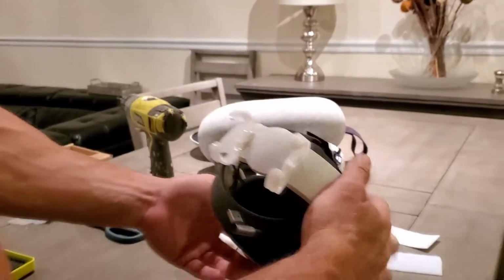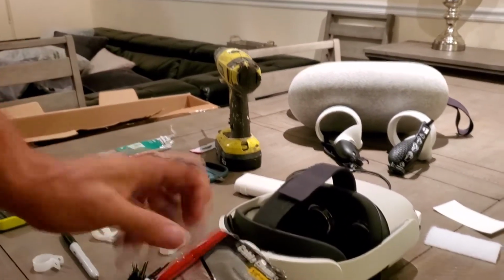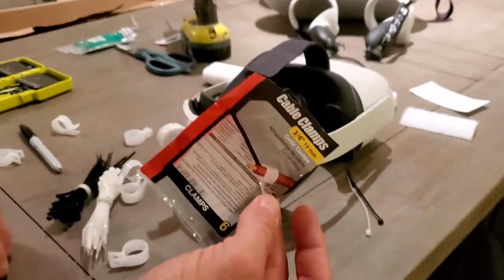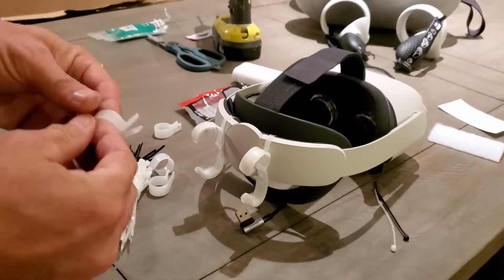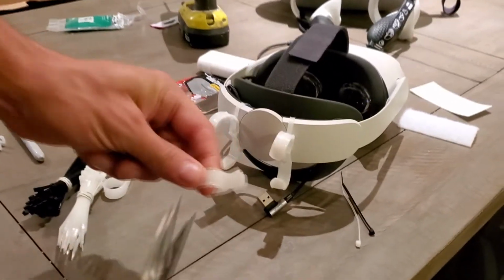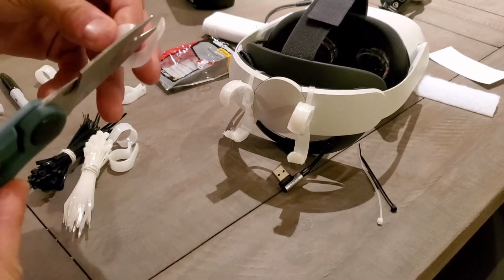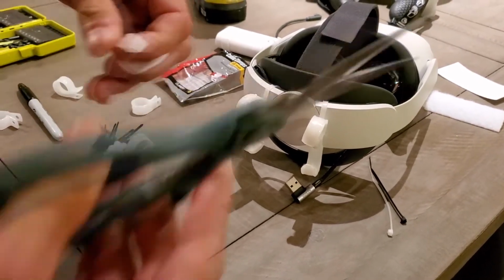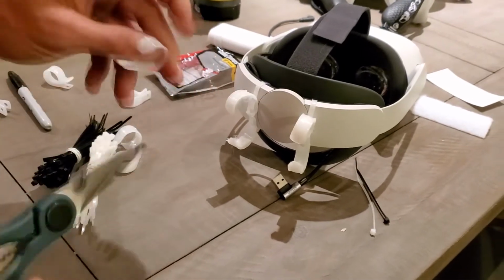So they're clamps that are used in the electrical department. They're 3/4 inch cable clamps, Home Depot, quantity of 6. They come like this. So the first step is to, hopefully my daughter's getting what my hands are doing, cut off these tabs here and then nip off, shape them how you want. I preferred it being a little kind of rounded over.